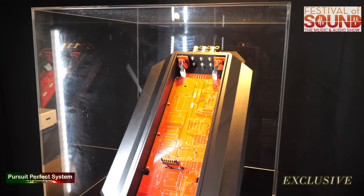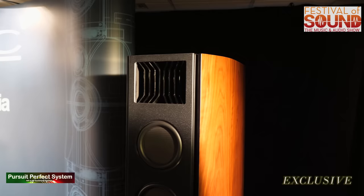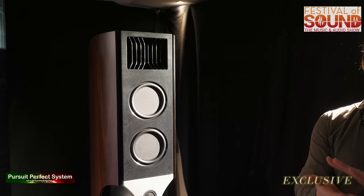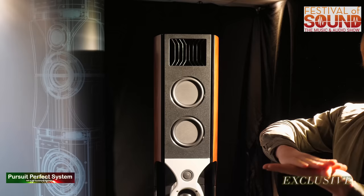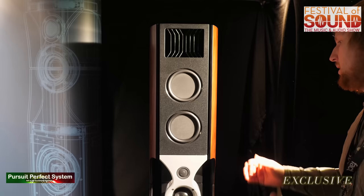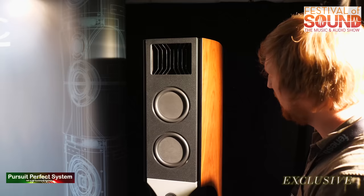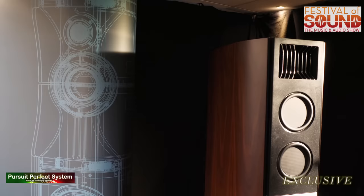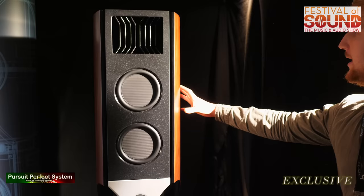Moving on to the finished product. Here on the loudspeakers themselves, it's a twin transmission line. We've got basically two base cabinets with four of our brand-new six-and-a-half-inch flat piston drivers, which use a new composite weave carbon fibre — two layers of carbon fibre sandwiching a damping foam. It's incredibly stiff because the carbon fibre weaves are opposed at 90 degrees to each other, giving an incredibly rigid but very light diaphragm. It's also incredibly controlled and detailed at low levels. The side panels — the wings — are again mounted on anti-vibration mounts. The whole wing moves; it's all compliantly mounted, and the side panel mass-damps the side of the cabinet. The wings vibrate in anti-phase to the vibrations coming from the side of the panel and cancel them out, so you get no sound emitted from the side of the cabinet — removing unwanted coloration.